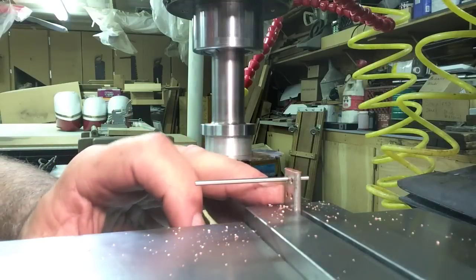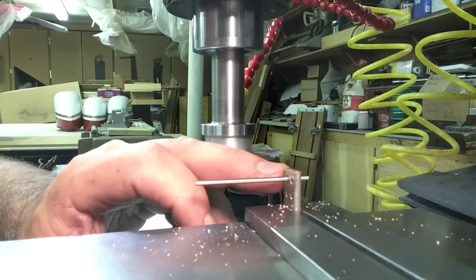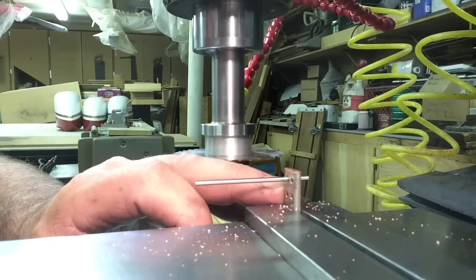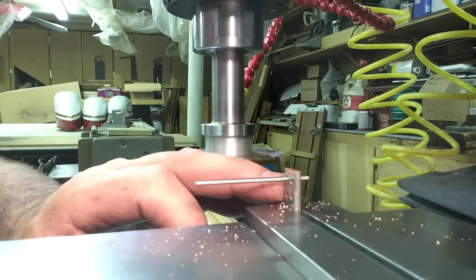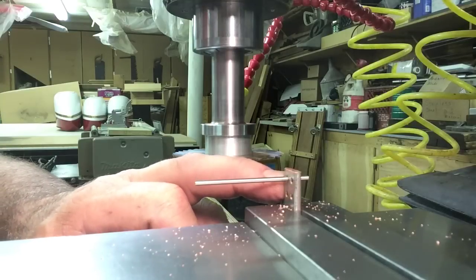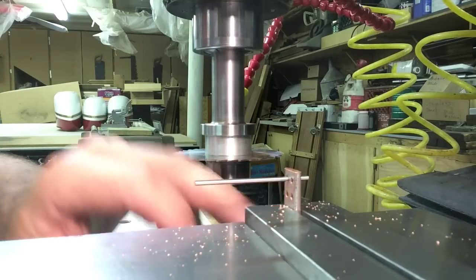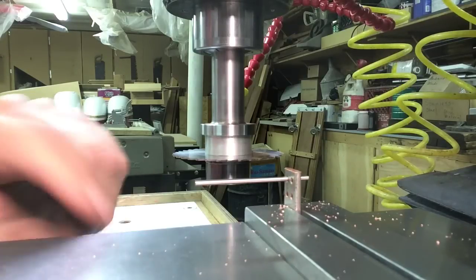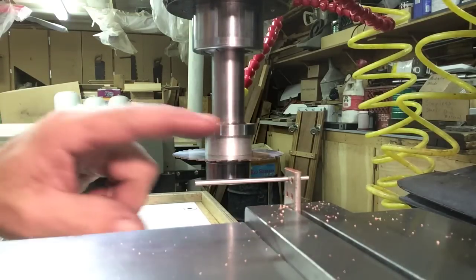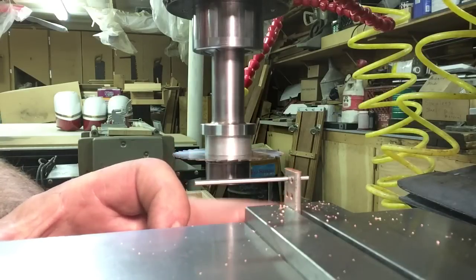And then we might have to do a second cut because of the spread on these things. I think it was originally set up for about a 50 something thousand saw. So we might have to do extra cuts, but it's copper, it cuts pretty easily. And we're gonna end up with a bunch of little bars. Okay, so that's what we're going to do. We're going to touch off and then move down, or move the table up, I should say, but 59 thousandths.